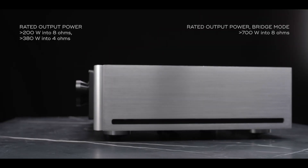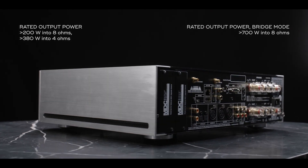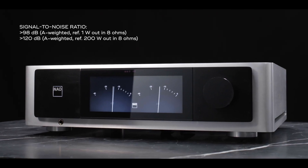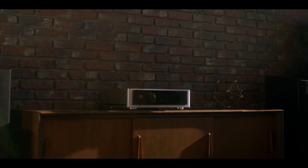It has a very, very wide open bandwidth and a lot of negative feedback to drive down the noise and distortion to unprecedented levels. That amplifier is so good that it's at the limits of what the very best measuring equipment can even measure. Sometimes you don't know whether you're measuring your own equipment or measuring the amplifier, because it's at that incredibly low level.